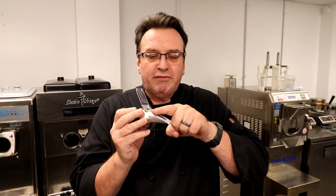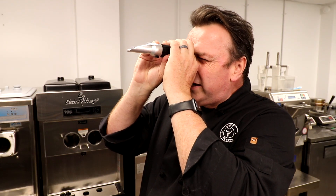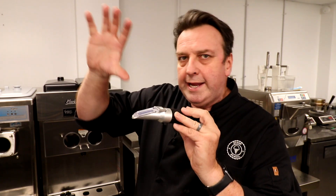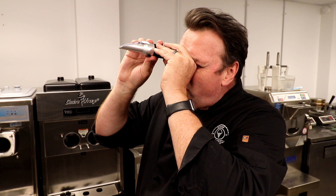Once you've mixed it up, you put a nice film of the solution on the viewing plate. The flap presses that sugar emulsion syrup over your viewing plate. Then it's a matter of looking through the sight glass — you'll need some downward light. You'll see a range; this one goes from zero to 32. You'll see a blue and white melding of colors, and where that color changes is where the percentage is.